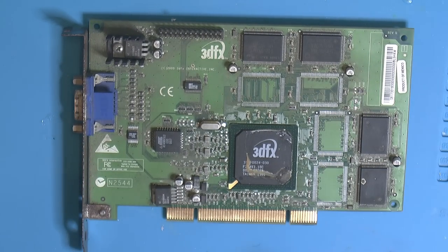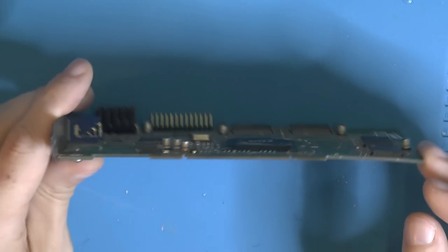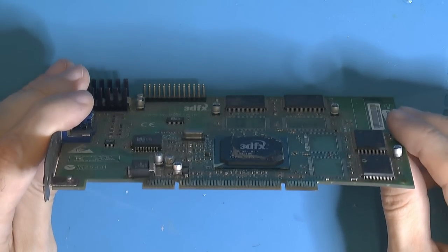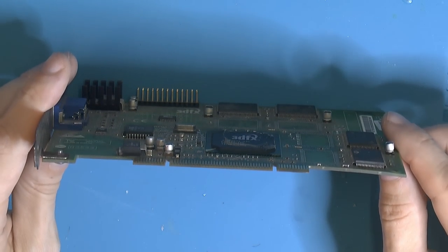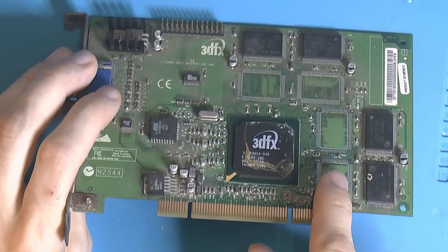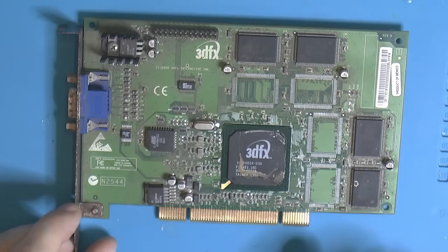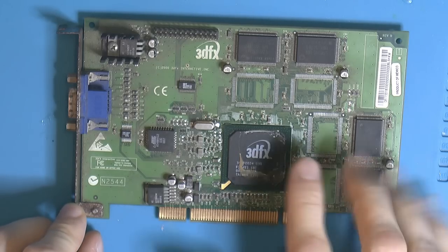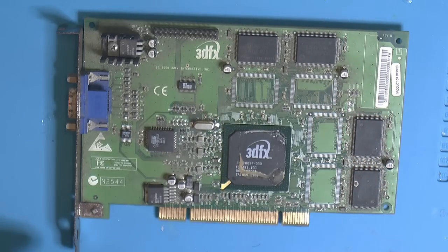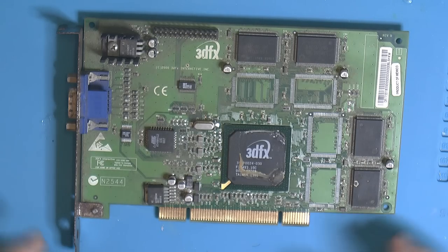So I googled and searched, like, can I undo this? Because the reason I want to undo this is twofold. One is aesthetics, this just looks dumb. Even if I could work with it, with surface mount and through hole, that's fine. But if you're talking BGA, like if the PCB is bent in relation to this and these balls are cracked, there's no way to get this on again. One reason I want to make sure this is as straight as possible is if those balls are cracked, we need to reball this. One way to find out is to reball and put it on again. I suspect we have to do that. Then I need this flat. So the question is, how do I unbend this?